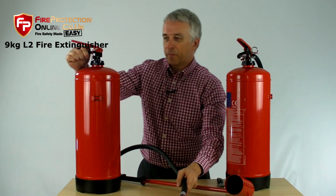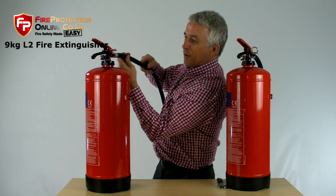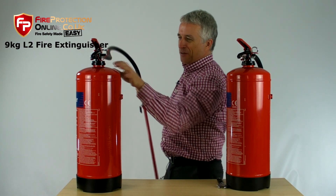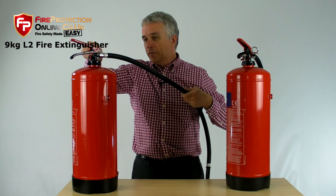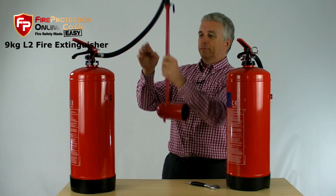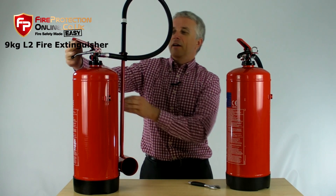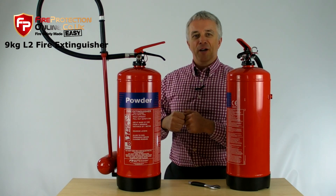This is the bit where I turn this around — one thread. Put this bit down here and carefully screw that in. Look at that — it only worked first time. One adjustable spanner — let's just knit that up nice and tight. Then this fellow will tuck over; it has a natural bend in it, and a hook to go on. Slot that over the top, that hole goes in there, and hey presto — one beautiful L2 powder fire extinguisher, ready to go. Of course, you can stand them on a stand, on a plinth, on anything. Just make sure it's in the right place.